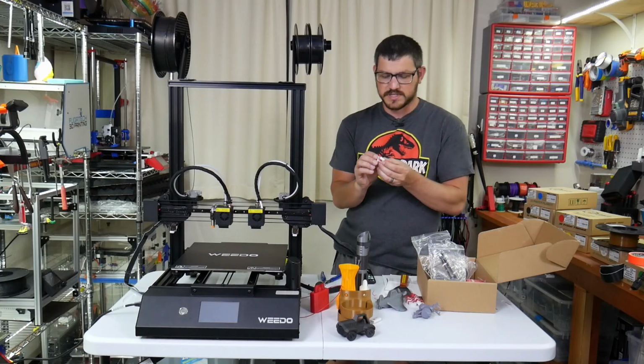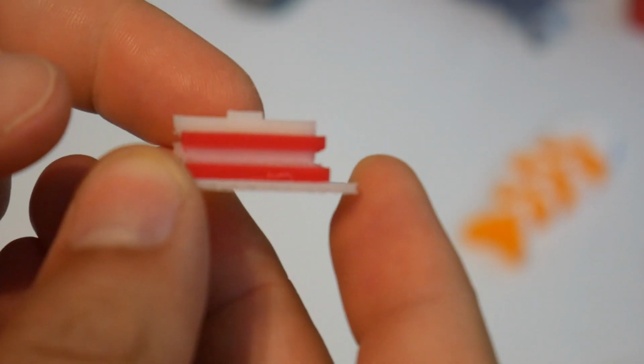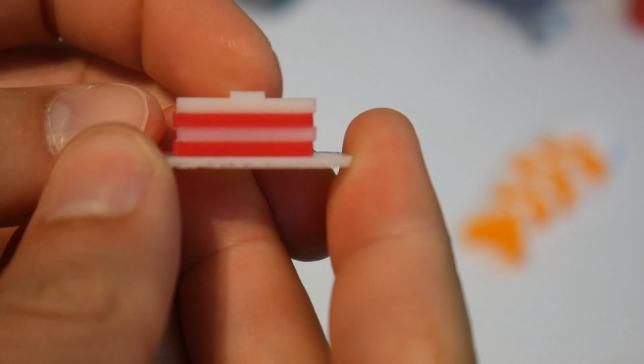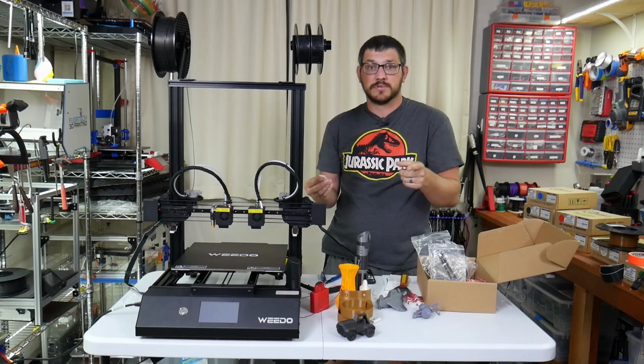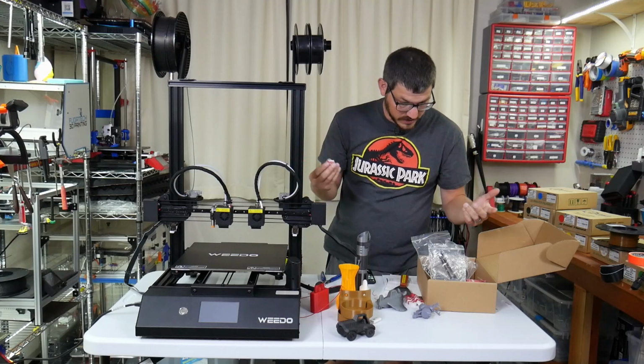So I decided to ignore that because I'd done it again as well. And I went ahead and printed out this little 2-color one that they had on there. Now this one, you actually measure the difference. This one's also a lot faster to print. So by just using a pair of calipers and measuring the difference, how offset the layers are in either direction, and then you just make your adjustments in the firmware. It gives you the options on what to pick, and then it lines up perfectly, and then you're done.